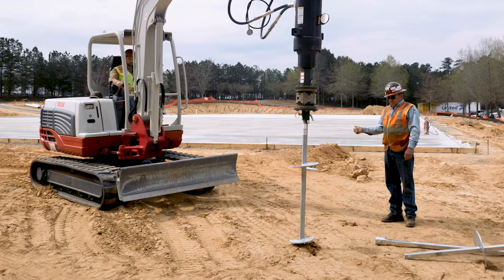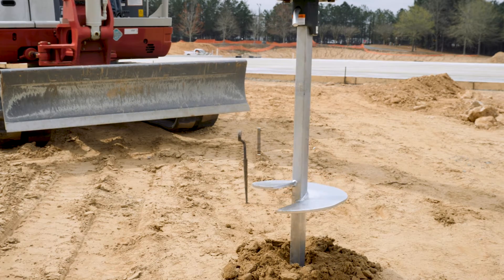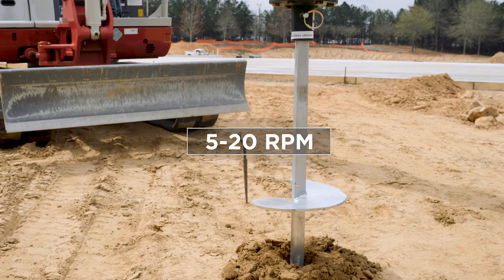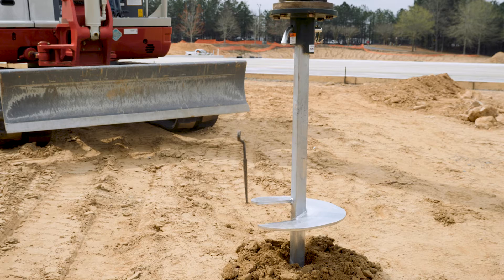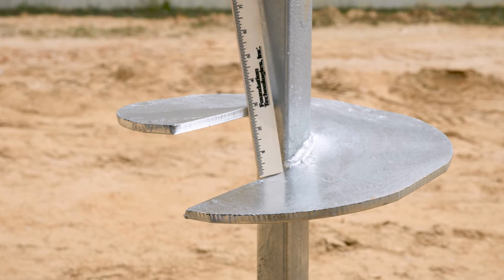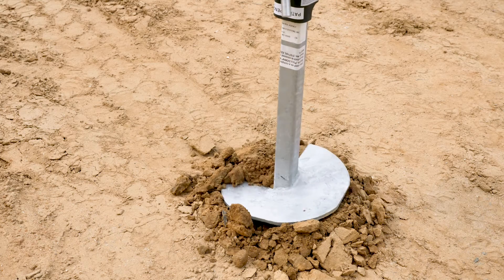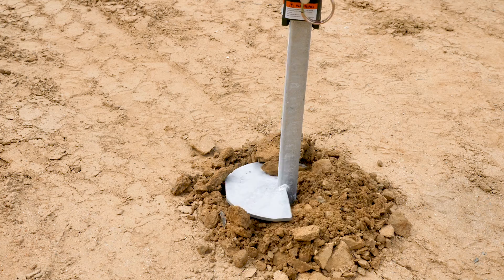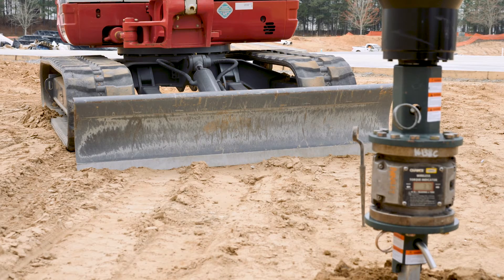The rate of installation is an important criteria to monitor. The helical pile should advance in the range of 5 to 20 revolutions per minute. With each full revolution of the shaft, the pile should advance the pitch of the helix. The standard pitch of Chance piles is 3 inches. If the pile is not advancing properly at 3 inches per revolution, that can be called spin-out. Spin-out needs to be minimized as it disturbs the soil and can reduce holding capacity.